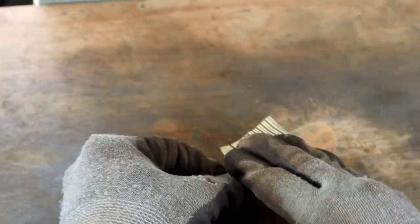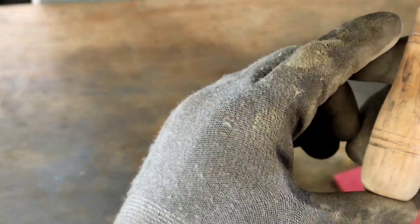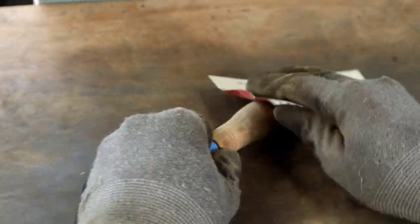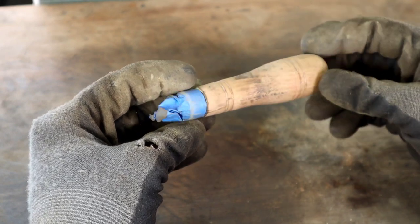To see more on what to do with deep pitting or how to polish, check the description for links to videos that showcase these techniques. The handle of this saw received a two-stage process. I started with 150 grit to do the bulk of the knockdown work and to remove the scratches. Remember to sand in the direction of the grain, otherwise your sandpaper will leave directional marks that stick out after you stain it. I finished the sanding with a 220 grit, which gives the wood a smooth, soft feel and it looks great after you stain it.